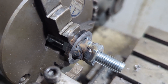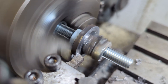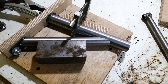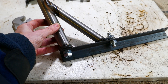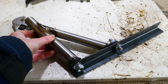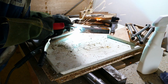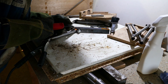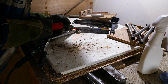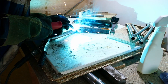This is the end plate on one of the top tilting arms. The nuts are welded on the inside. I also use a metal jig for the full welds, as I was getting some distortion on the assembly. The tubing is very thin and the end plates are quite thick, so it's quite difficult to weld the two together without getting blow through on the tube. I found the best approach was lots of little intermediate welds.